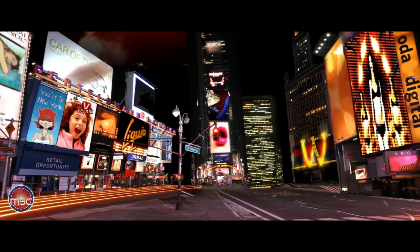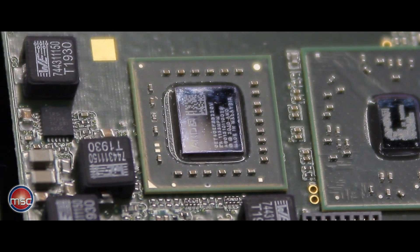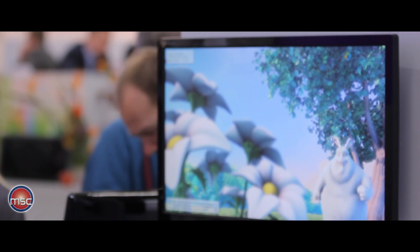What is most important about the embedded G-Series or the Fusion family is the graphics performance and also the computing performance integrated on the same chip. The chip is capable of supporting dual independent HD interfaces, and both displays can, for example, display a different MPEG movie decoded at the same time. Some more graphics-intensive features can also be realized with this new family of processors.